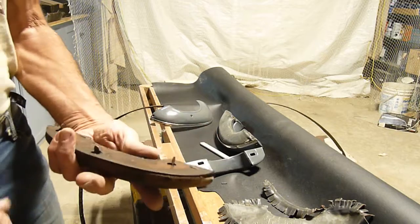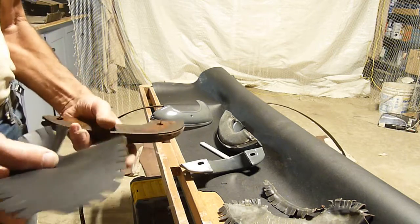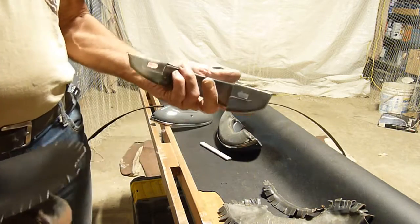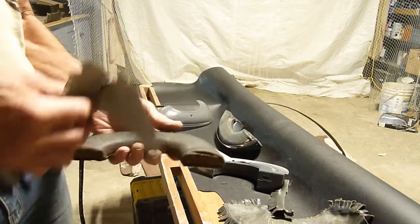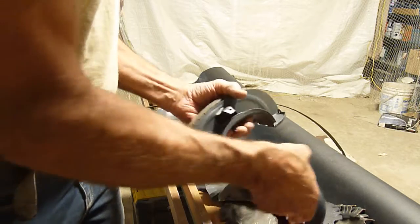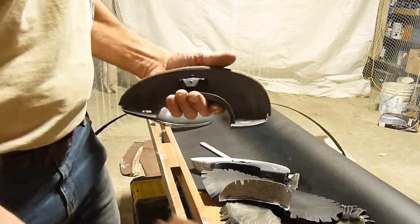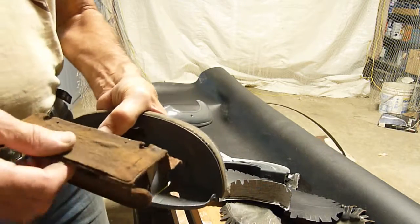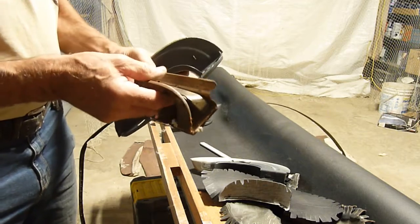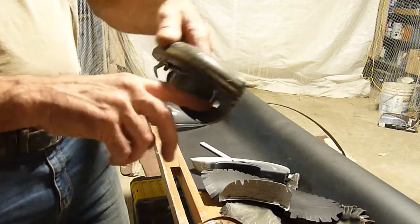I'll clean off this side, then this piece gets glued through here — I'll stretch it, put it on, and put it back together. Then I'll put those two on the door. I did cut some pieces yesterday to adapt this; just a light filing on the inside makes the bolt holes the same distance apart. This one fits against the door at an angle, so the screws mount up into the door at a 45-degree angle.